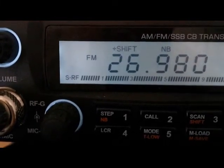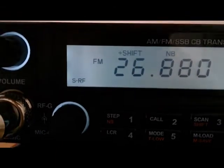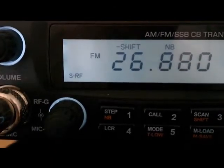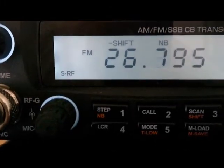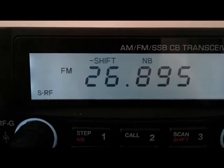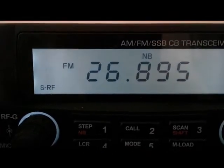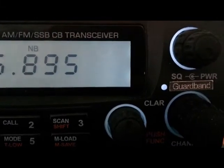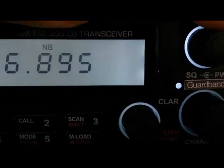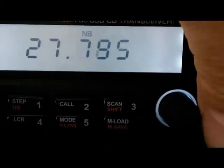You can see 26 MHz shift — it goes up 10 kilohertz. Program shift again into the minus and it goes down 10, so from 95 it goes down 10. You don't normally see 26 megs and a shift on a radio. Everybody PMing me saying it's just an Albrecht — no it's not. It started life with a different design; the name is a Super Jopix but it's not one of those either.